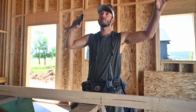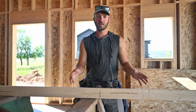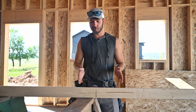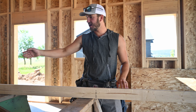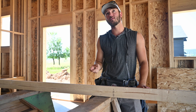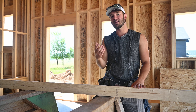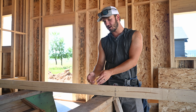Then you can just throw all these boards in, put them on the spacing, and nail them off. The tricky part is when you have weird spacing in the trusses. Three of these trusses up here are shifted ¾ of an inch. So I would just mark this out like normal, and then based on looking at the roof truss layout, I would know to shift that over and measure up there and nail it in.